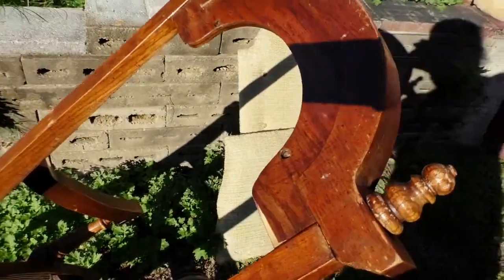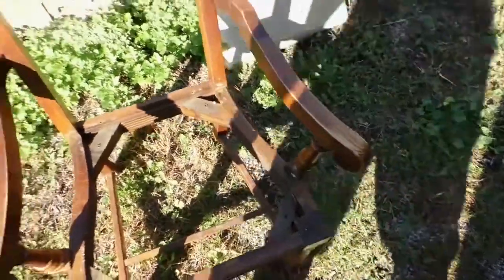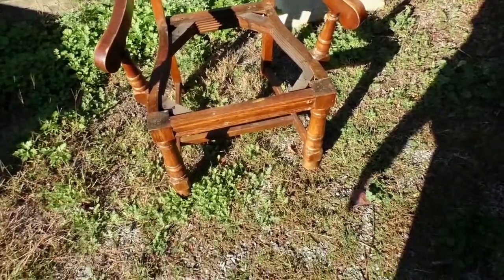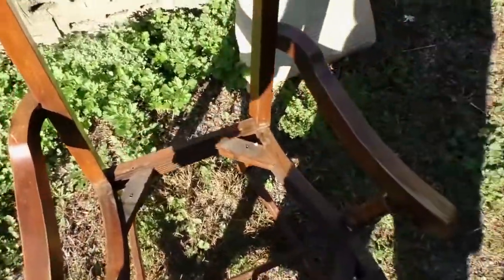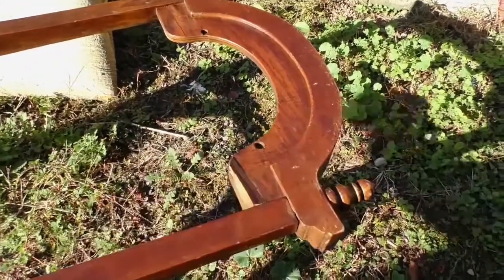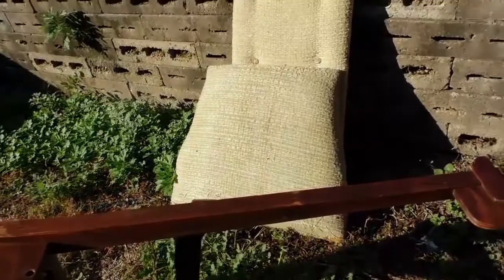then you're not going to have screws - it's probably going to be wood. But you can see here there are a few screw holes and that's all that was holding this together. Now I'm going to need to put some putty or some little wood pegs in there when I'm done to cover up those screws, but the chair itself is in pretty good condition. It's nice and solid and heavy. The only problems I'm seeing are this leg in the back is split right here, which we're going to fix, and this leg is missing some wood. So this chair is not that old - I can tell by this crappy wood veneer. We're going to go ahead and fix that.